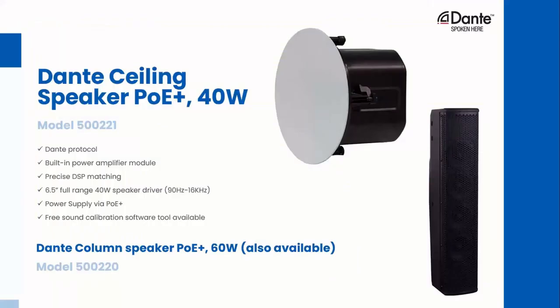We have both a ceiling mount and column mount speaker. We'll start with the ceiling mount speaker. This device supports the Dante protocol. It is a ceiling mount 40-watt speaker, so it has a built-in 40-watt integrated amp. The device is powered via PoE+, so you don't need any external power supply. You draw power from the Ethernet switch supporting PoE+.